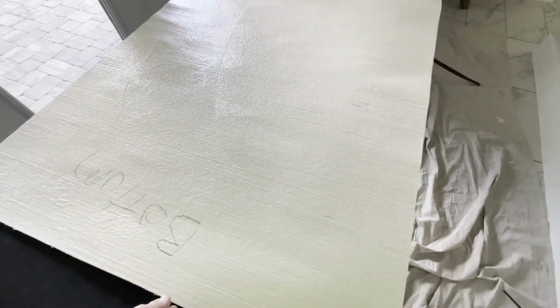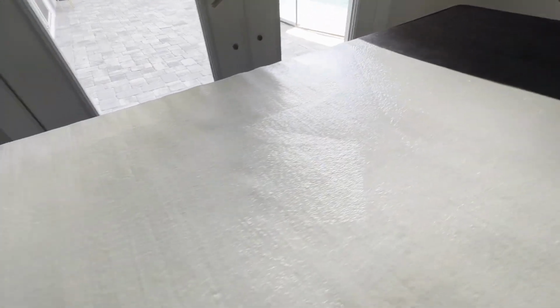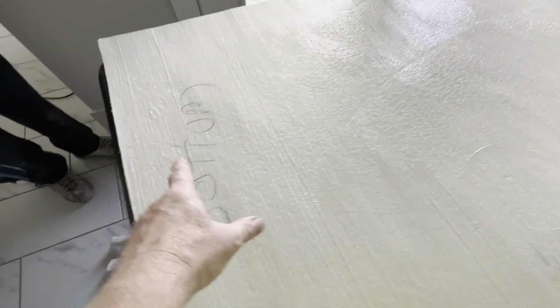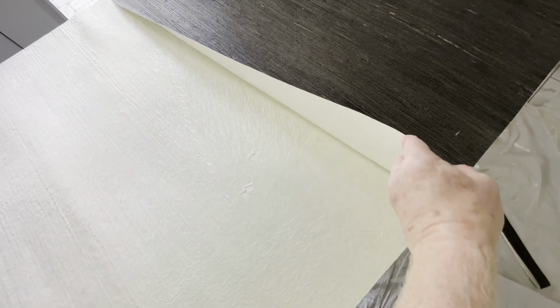When you're hand applying your paste to the back of your grass cloth, you want to use the light and that shine to make sure you got everywhere. Sometimes you'll see a big bald spot, okay? Secondly, we remember bottom, and when you're hanging paper, you want to take the bottom, flap it over to here, put it under here. Why is that? Because if this is on top, you'll remember more easily, that's your top.